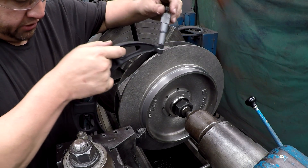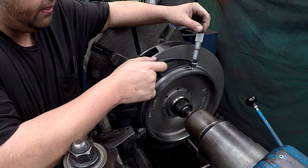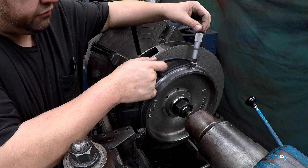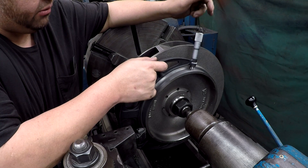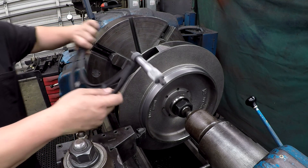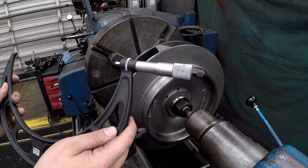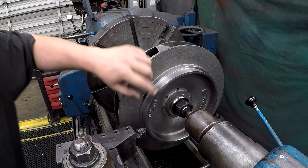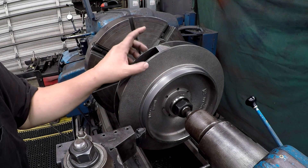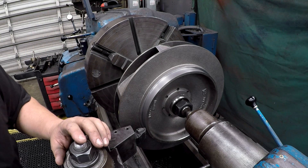Let's see if we hit our mark. I'll use the friction thimble this time to see what I've come up with. Looks like 962 — that's what I wanted. So we just need to chamfer this edge like I did the other side. I've already filed this right here, but we'll chamfer that. Got one more to do.